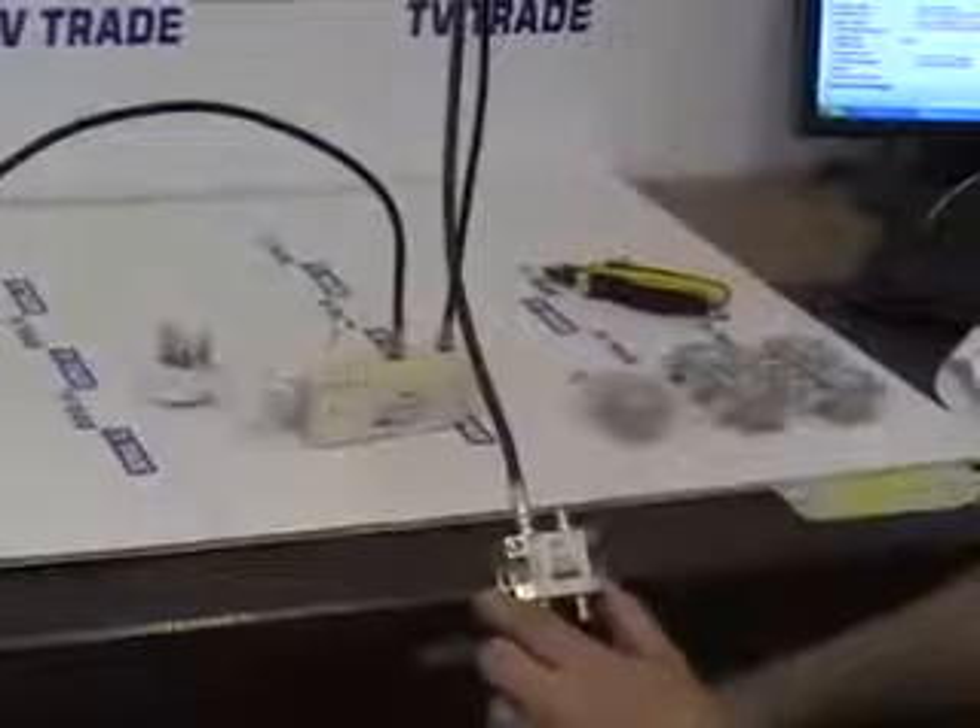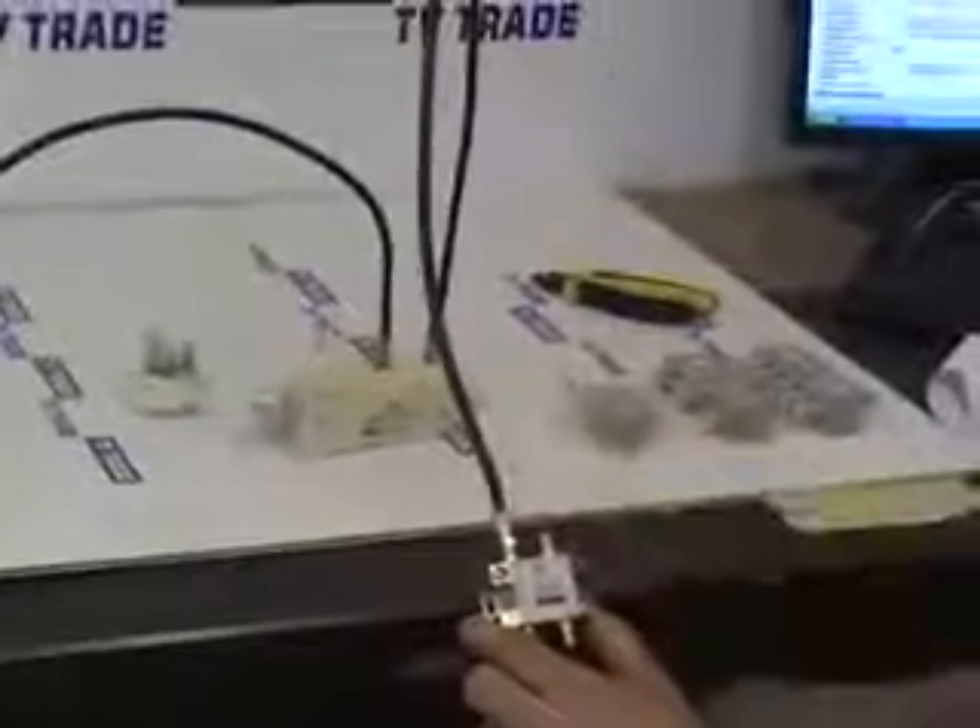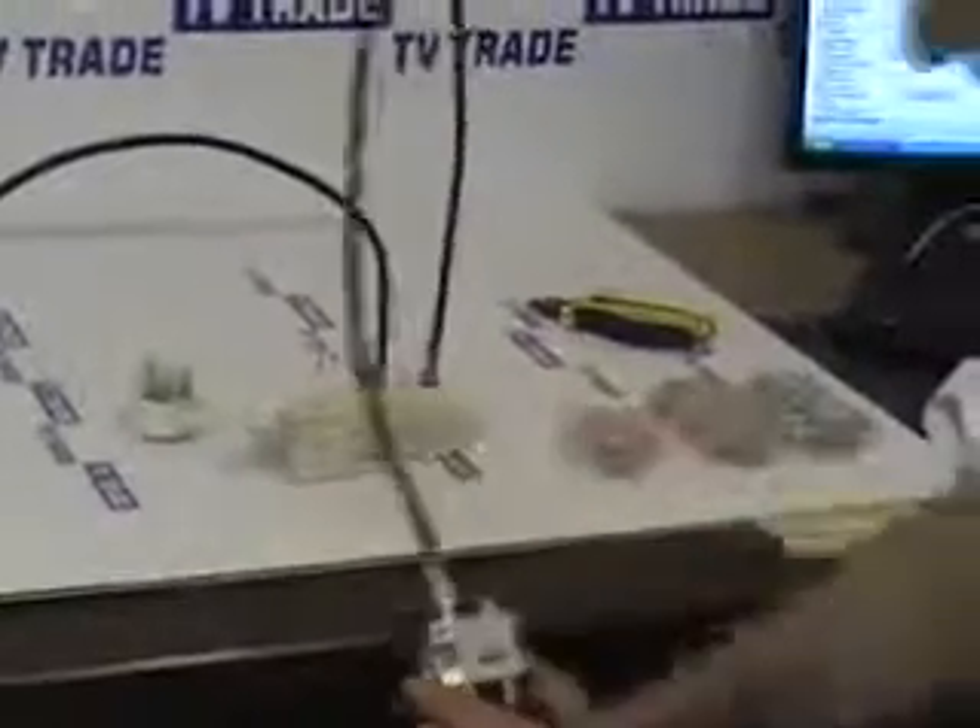On this particular path it's essential that we have no obstacles that would stop the flow of the 12 volt signal. That would exclude using most face plates and also generally excludes the use of coax connectors and coax joiners. F connectors are ideal for this particular job.